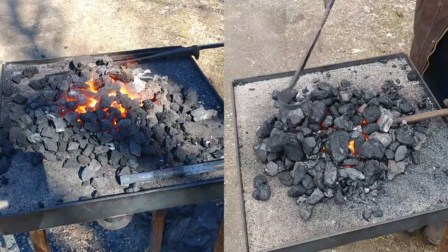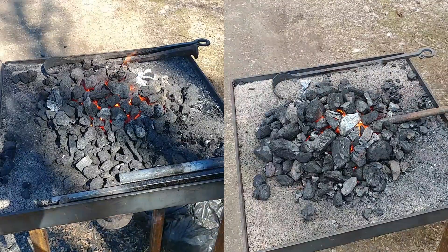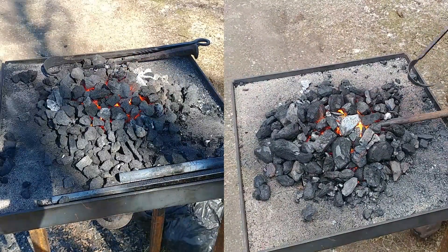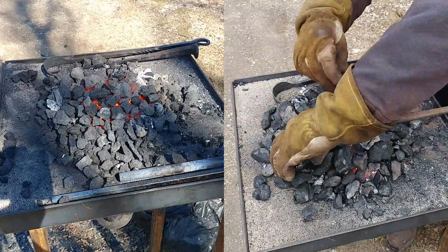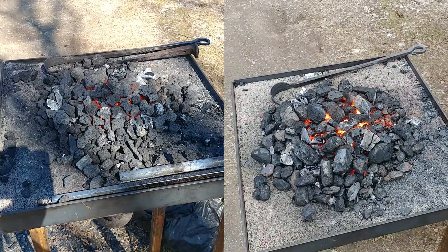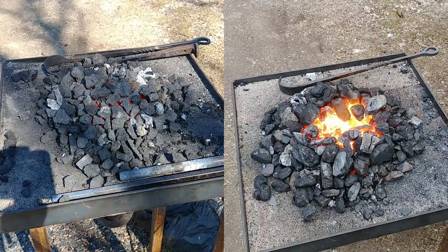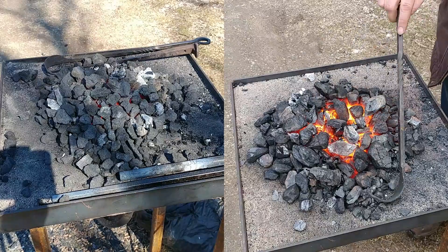You're going to need a lot of air, so make sure you get a really good strong blower — a minimum of probably 400 CFM. I would say that would be a very recommended amount for a blower on that end. And a very deep fire pot. These things will go greatly to help you in working with anthracite.